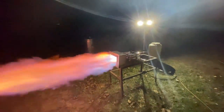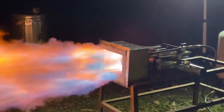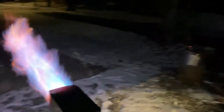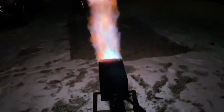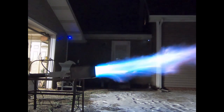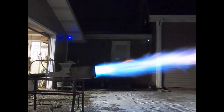Here it is after running for a while. This flame would be about 1,900 degrees Fahrenheit, whereas when you have air blower augmentation or compressed air augmentation, you get about 500 to 600 degrees hotter in some cases. So we could be at 1,900 degrees in one case, and right here you're looking at 2,500 degrees when it stays lit anyway. You can see the difference in the color — it's just drastic. It's a completely different beast altogether.